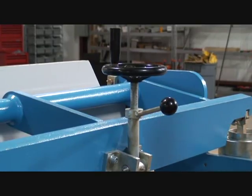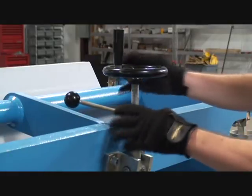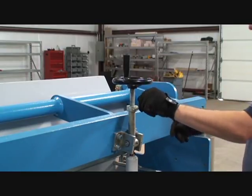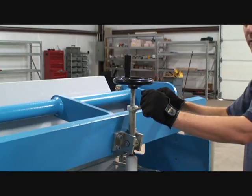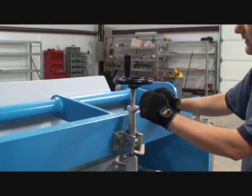All the air brake models also come with a stroke adjustment control with a locking handle. You unlock the handle and turn the hand wheel to adjust your bending depth, then lock it back. This becomes your positive stop. There's no more accurate way of bending than a positive stop — every time the press brake comes down to the bottom of the stroke, it stops at the same point. So if you get a 90-degree bend one time and don't adjust your stroke length, you'll get a 90-degree bend every time.